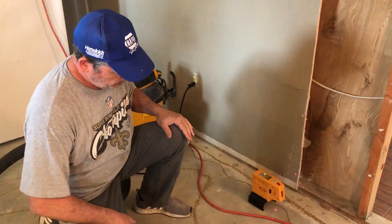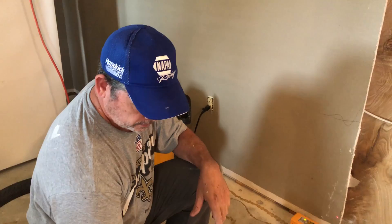The other thing I'm going to do is make my slot in the ceiling four inches wide, because a two by four is three and a half inches. That gives me a quarter inch of room on each side to put in our two by four. And then when we hang our drywall on our wall, it'll push up and cover that gap just like new construction.